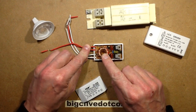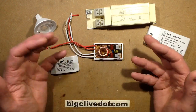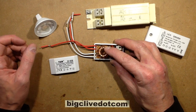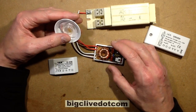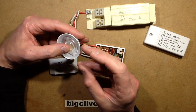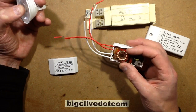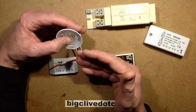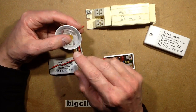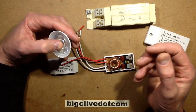The main thing is that the output of this is not a lovely sine wave — it's a sharp series of spikes. For a halogen lamp with a filament in it, that's no great problem; it just averages those spikes out and you end up with an equivalent 12-volt supply. But the spikes coming out of this usually exceed 30 volts and they're at 20 kilohertz. Some LED lamps can handle that, some can't. Some struggle with the frequency if the rectifiers aren't rated for high frequency. The ones that do rectify it end up with a really high voltage — 30 or more volts — and it damages the lamp. Particularly the most basic ones that just have resistors and LEDs — that absolutely kills the LEDs.